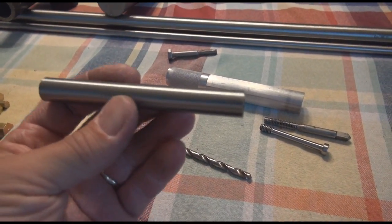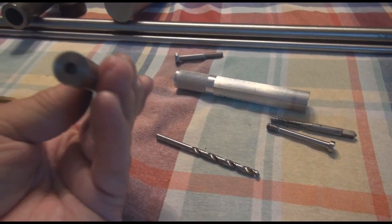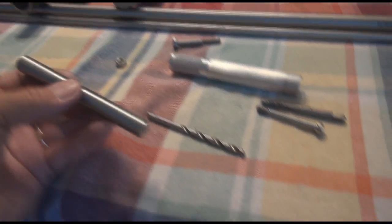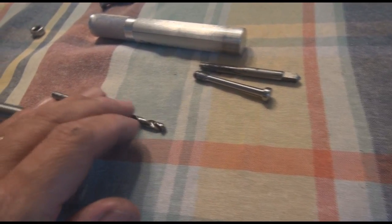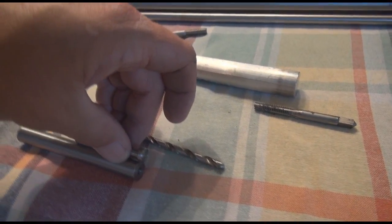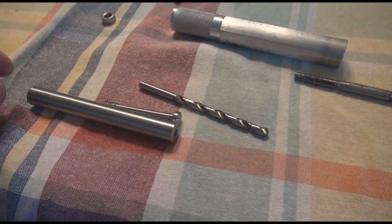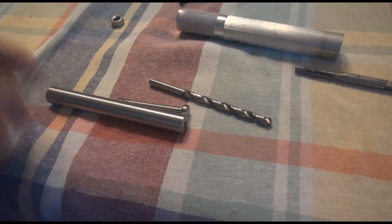So far I've cut off four inches of half-inch drill rod. I'm going to put a little center tap hole there, drill it out with this drill bit and then go a little bit bigger around, because when I clean it up, this is going to fit inside — kind of like a little pocket — for this, because it's going to end up being a special tool later. It's going to go crossways.